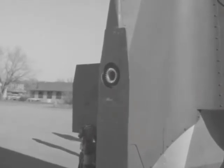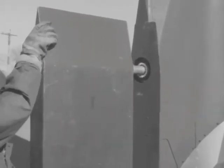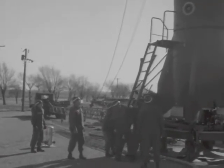Next, 4 steering rudders will be attached to the 4 tail section fins. The rudders work in unison with the carbon jet vanes in the exhaust plume for steering during powered flight. The fueling ladder is now being positioned on the thrust unit.